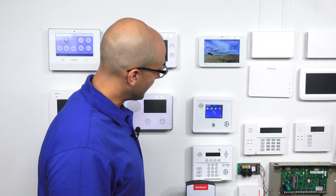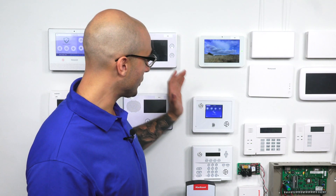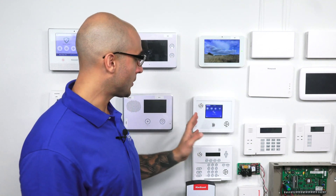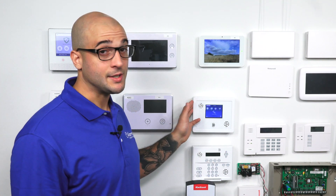On the XTI, the system currently isn't monitored, but it does have the Z-Wave controller installed in the unit. The caveat with the home automation features with this particular system is that the Z-Wave controller is actually built into the Alarm.com cellular module. The cellular module itself is not exactly a cheap part, so if you are looking to use home automation with the system, it really makes sense to get the system also monitored, as you're going to be paying a premium for this piece.